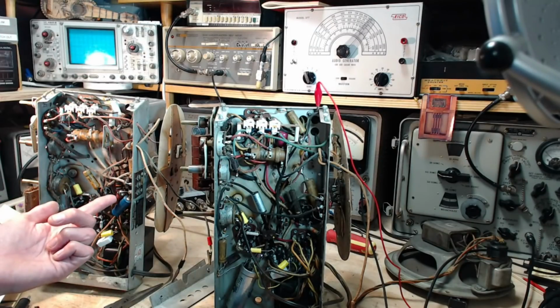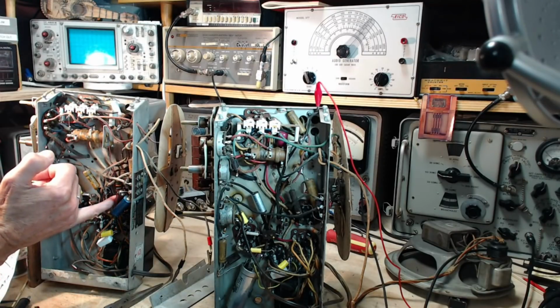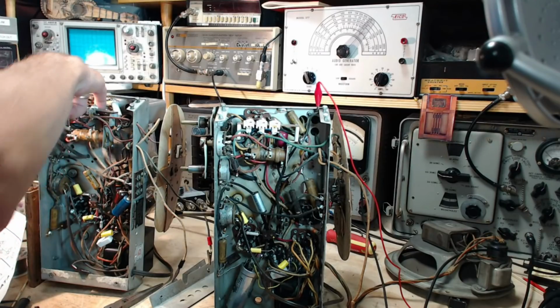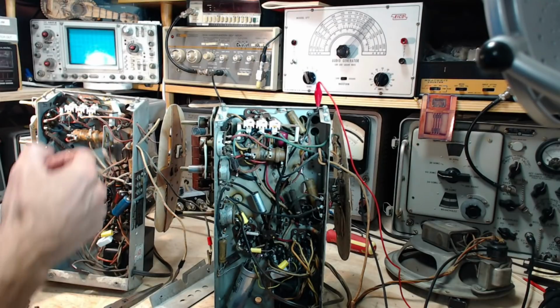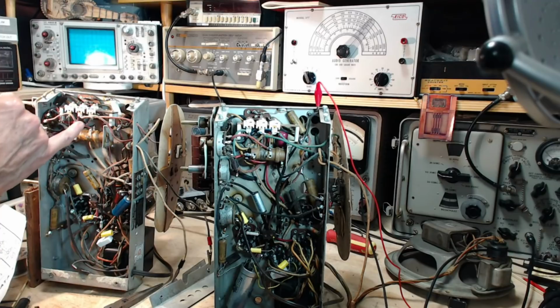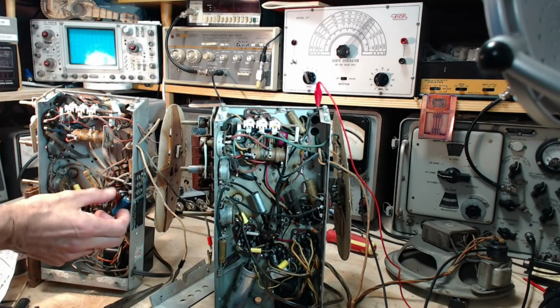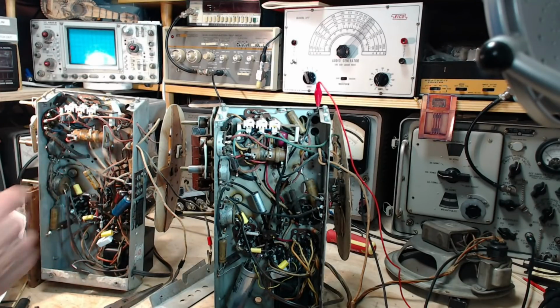And how did they get them here? From here, there's a wire that runs from this terminal. This red wire runs all the way up to a terminal to which the capacitor's soldered over here. And the other end of the capacitor is just going to the chassis. So all they've done is move the capacitor from here down to here. This combination capacitor has one end grounded, the other end at the other end of the red wire. But I'm thinking, wow, maybe that's not the best move.